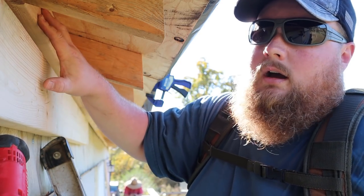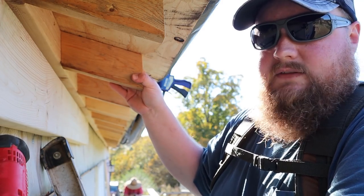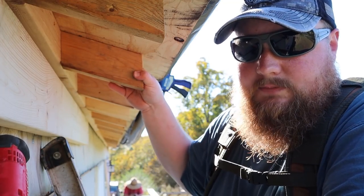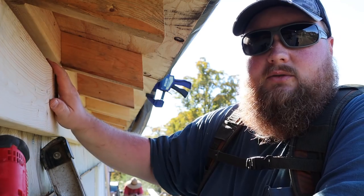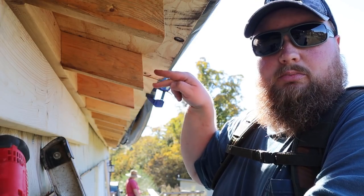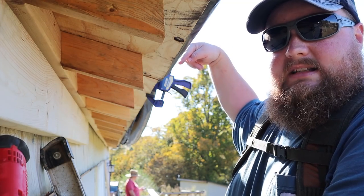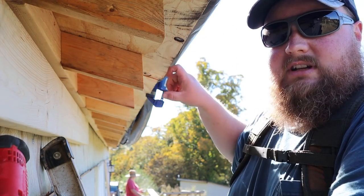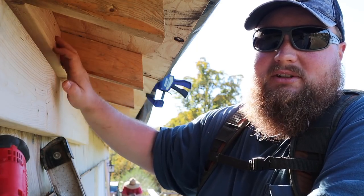These. The plywood then gets tacked through the top into the fly rafters themselves, and those are being attached with 3-inch long Torx drive exterior grade deck screws, or exterior screws. They're not just decking only. I then come back with the 2x6, which is what I'm just about getting ready to get put up, and I attach them two per fly rafter with 3.5-inch screws, and then I come down the length of the 2x6 and pin the plywood down into the 2x6 using the 3-inch screws. When it's all said and done, this becomes extremely strong and extremely rigid.